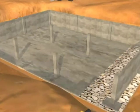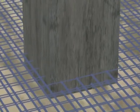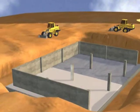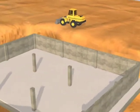Basement joints can be sealed very effectively using Dr. Fix-It water bar before the slab is cast. Water bar should be used at the junctions of the slab with the retaining wall. It should also be used at all the junctions between the slab and the columns. After this, the concrete slab can be cast. If Dr. Fix-It water bar is used as directed, all these joints get sealed permanently.